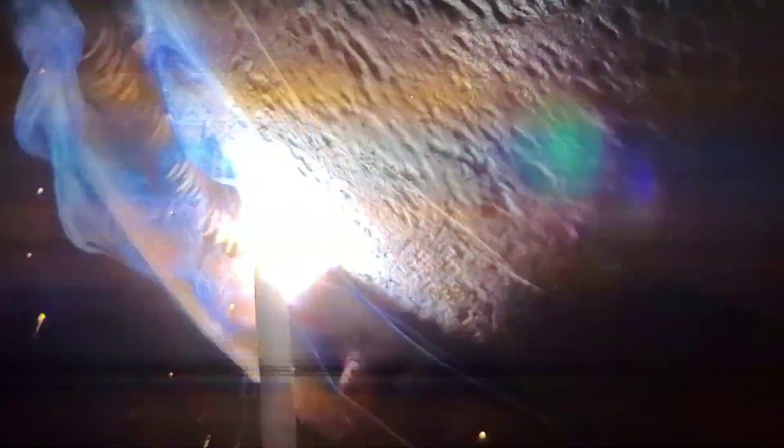You can see that I kind of swipe it side to side, which is like a zigzag. I make sure when I get to the pipe that I let it spread well onto the pipe so it doesn't undercut it so hard. What you should be focused on is the brightest part of the puddle — the brightest part is the metal, the rest is just slag falling off.